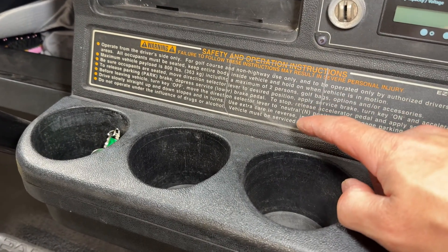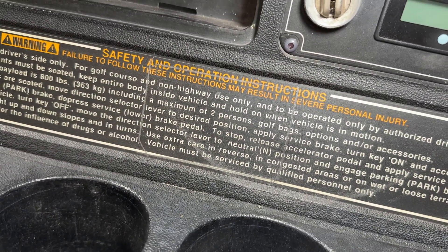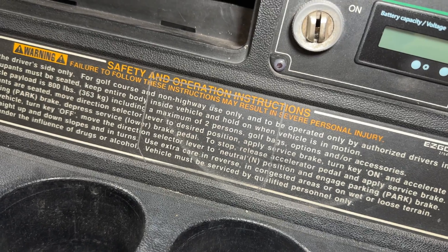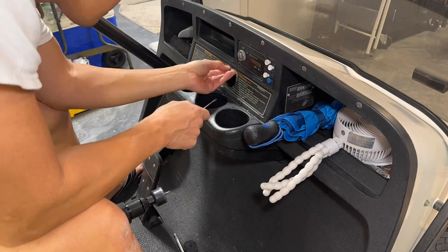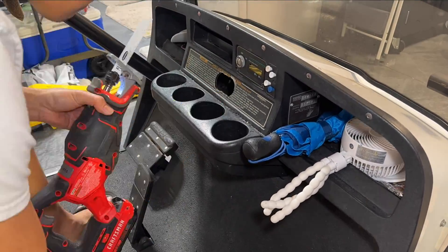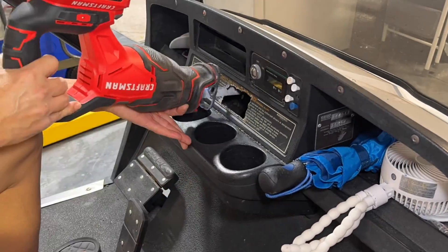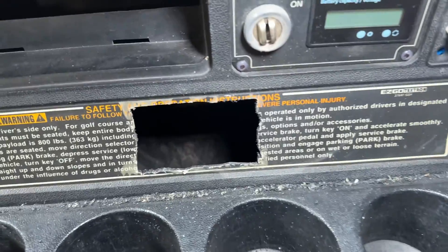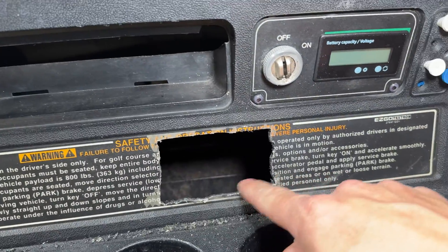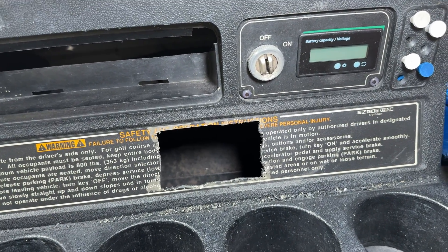So I went ahead and marked with a pencil the outline that I need to drill. I'm going to go ahead and just use a hole saw right there and just drill two or three holes depending on how many I need, and then after that I'll just use a reciprocating saw or something and cut a rectangle to fit the thing perfectly into that hole once we drill the holes out. Using a reciprocating saw and the hole saw made quick work of this hole. The fine-tuning and trying to get it perfect around the edges is what's going to take a while. I'm about to go get a file and just work the file and just get this thing straight.